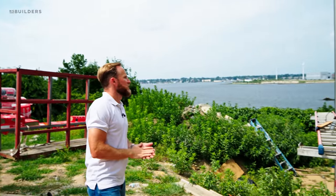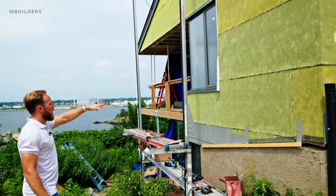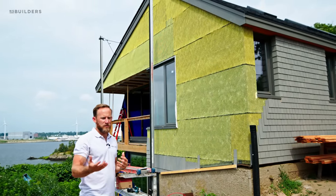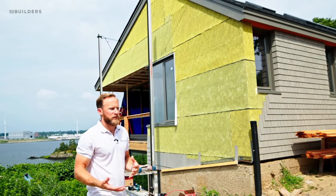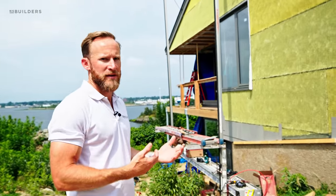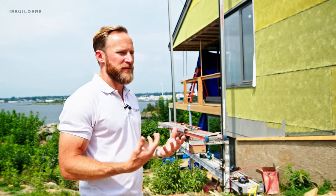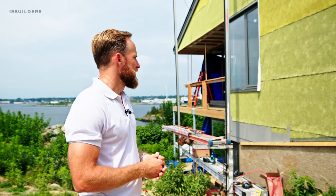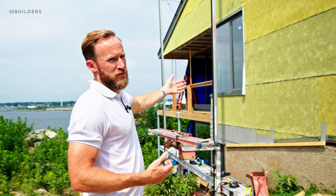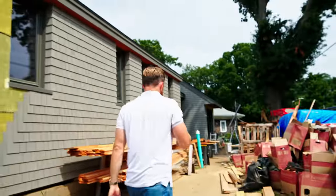Before we go to the garage, you can see all of our Slicker HP installed — the staple-up version, all prepped. A lot of you guys talked about how this stuff isn't necessary, and that's feedback we love to get. One of you said you've installed both, ripped both off, and saw no signs of moisture. I get it — we are working with some technical reps on what makes sense. The main downfall I heard from comments is that the shingles can break or it's more difficult to install, and of course there's the added cost, but this is very similar to tar paper being stapled up — you're just adding that layer for dryability on the back.